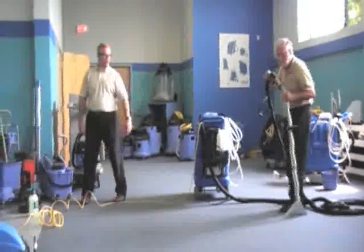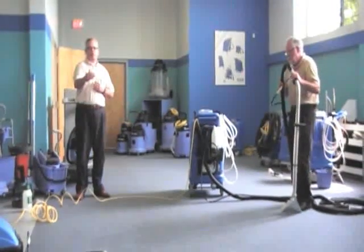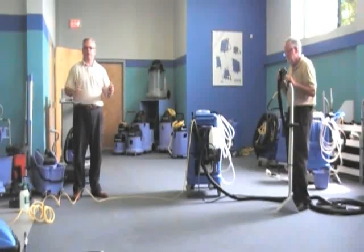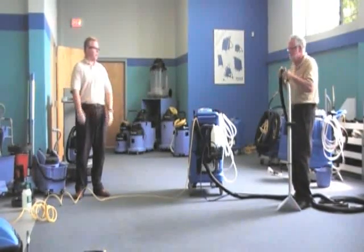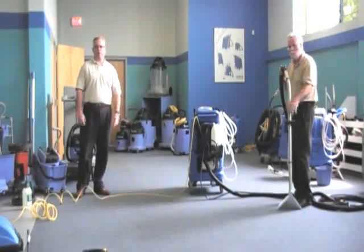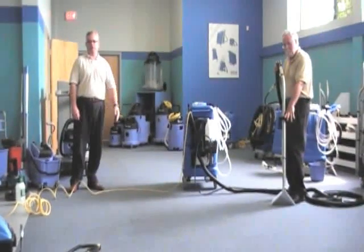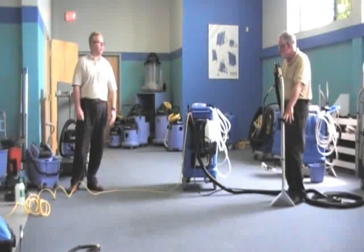At NaceCare, we refer to this as 2x4 cleaning, basically cleaning sections that are 2 feet deep, about 4 feet wide. Apply down and then pick up as Adrian showed you. At that point, you've completed your section. You just keep pre-spraying and moving on, getting the kind of productivity that you need. Thank you.